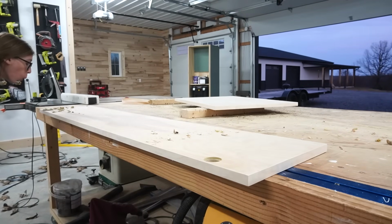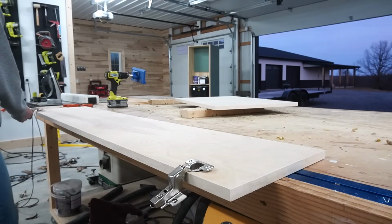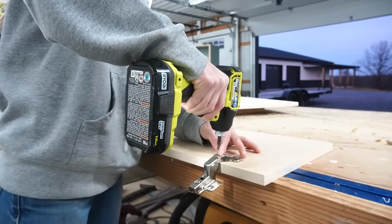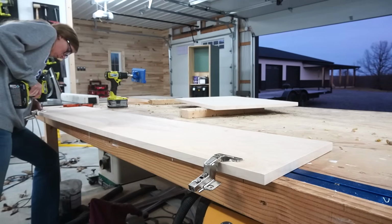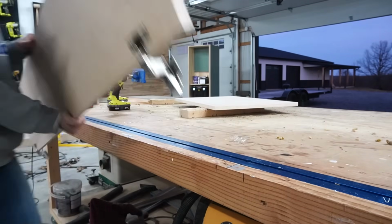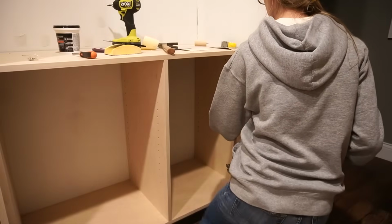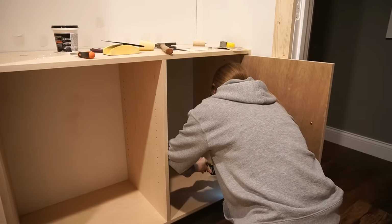I edge banded each of these, sanded them well, and then pulled out my Kreg concealed hinge jig to drill out holes to insert the hinges. I installed soft close concealed inset hinges into each door, then brought them inside to install them into the cabinets. I also have a guide for how to install and adjust concealed hinges that I will link below if you want to know more about that as well.